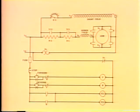Well, we had a diagram of a controller that stopped, started, and protected the motor from overloads. And we built in two different types of low voltage protection as well. A controller can do much more than that. One of the things we've added to this controller is armature protection. Now, before we explain how we did it, let's talk about why armature protection is needed. You see, if full voltage is applied to the motor, it's too much for the armature to handle on starts. Now, I don't mean to say the motor can't ever handle it.